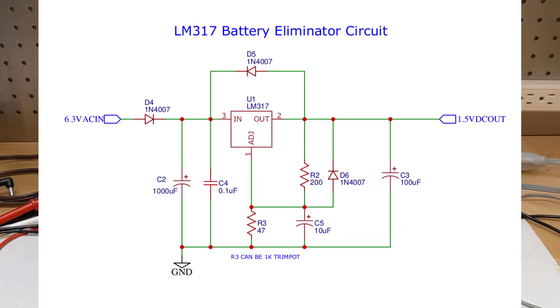A second and more sophisticated circuit is shown here. Variations of this can be found on the internet. It uses an LM317 voltage regulator IC to regulate the voltage. Some variations of the circuit omit the two additional protection diodes, D5 and D6, and some use a trim pot to allow accurately adjusting the output voltage. While more complex than the earlier circuit, this one provides better filtering and regulation and takes less current drain when not using the ohms function. I didn't yet build this circuit, but I have ordered some LM317 regulator ICs so I can try it out.